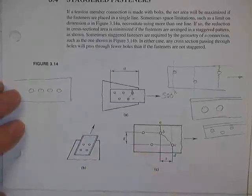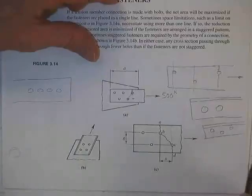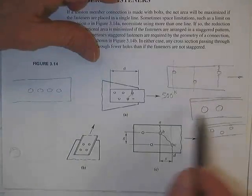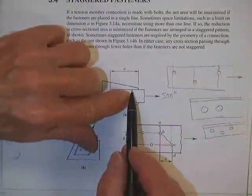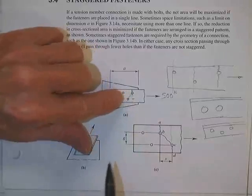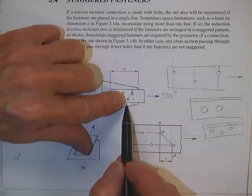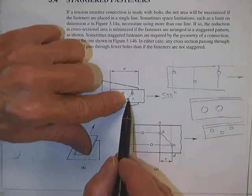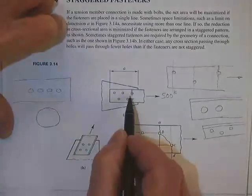And since it's longer, he says, "Well, I don't know." But since it's weaker through the hole, he says, "Well, yeah, I think." He picks the way he goes. You check them both. You check and assume that the net area is equal to straight across the plate with only 1 hole in there, or you take into account the fact that he tore through 2 holes.